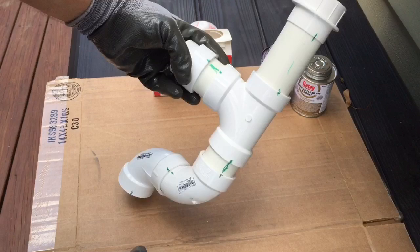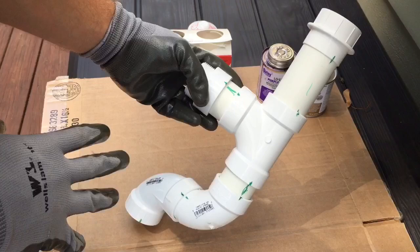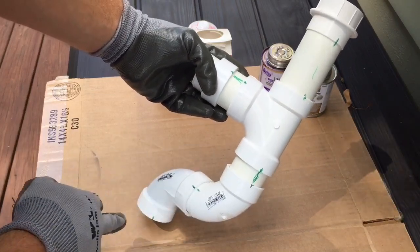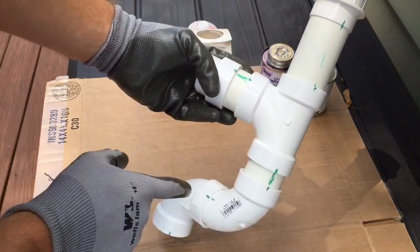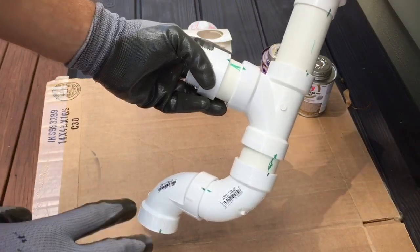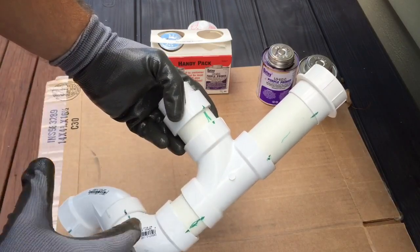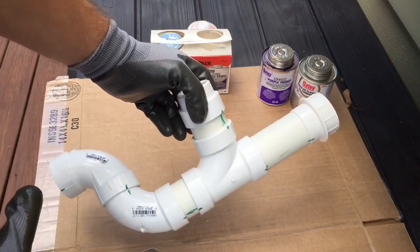What you probably want to do is put together the entire PVC pipe — press-fit everything, test-fit everything — without any glue or primer. And then, in any cases where you have bends and everything's not going to be flush and uniform, take a Sharpie and mark where these lines meet up. That'll make your life a lot easier because you can take all these parts apart, prime it, cement it, and push it all back together. It'll save you a lot of time and hassle trying to build this underneath the sink in place.